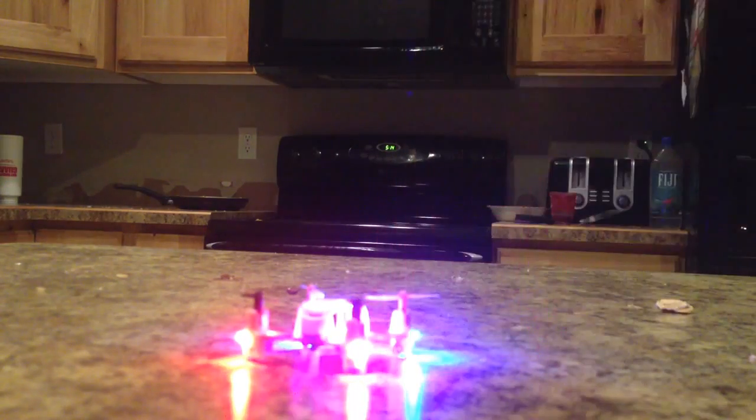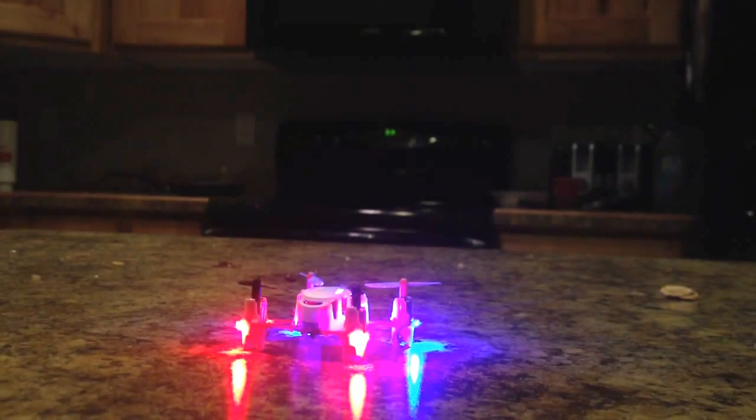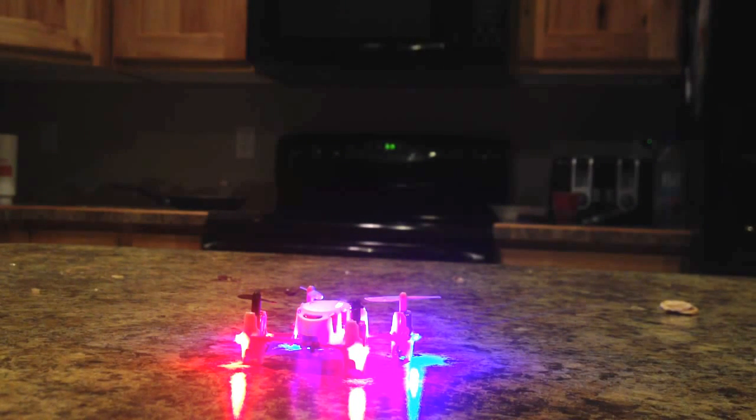Let's turn the radio on — we've got a signal lock. To calibrate the gyro, put the left throttle stick to the very bottom right and flip the right stick left and right until you get that flash. This is important because if you pull it out of the box and start flying without calibrating, the quad will drift left, right, forward, or back. You'll try to correct the drift, get disoriented, and crash it. So it's really important to get the gyro calibrated. Now let's try flying it with the new motor.